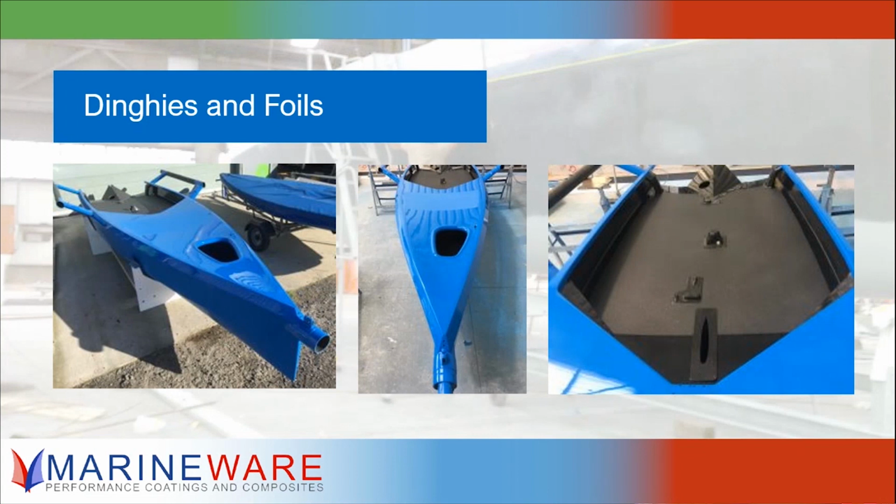Primarily it's very quick to use, which is why we like it. It doesn't take a long time to go off. You haven't got the waiting times that you have, for example, on 545. And it's a thicker paint as well, so you can spray it out of the gun pretty much straight out of the can and get a good thick build up for doing some fairing, but you can also spray it nice and thin to give you a finished top coat. The surface is very hard wearing once it's cured properly, so you don't get all that micro scratching that you would get with even any of the other yacht-based paints.